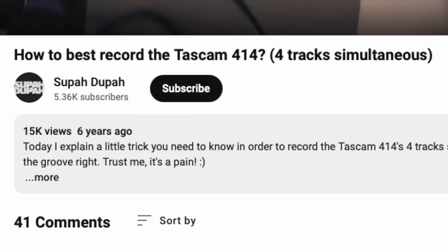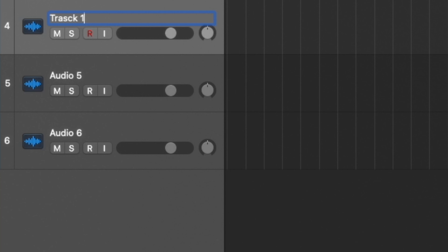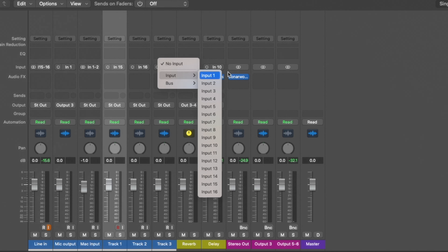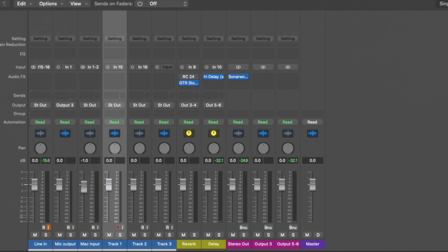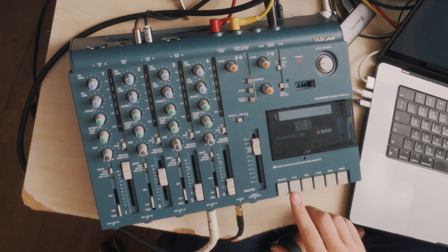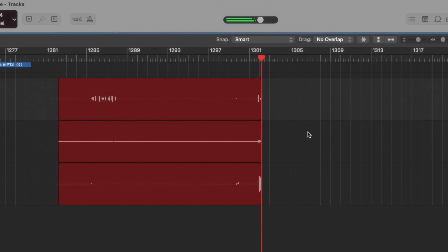The final way — at least in this video — to combine analog and digital is to use the four tracks, send them to the computer, re-record over the tracks, and essentially have unlimited tracks. Unfortunately track 4 comes out of the sync out and I don't have an RCA to jack cable, so we'll just use three tracks. Track 1 and 2 are coming into inputs 15 and 16 on my interface, and track 3 is coming out of Effect Send 2 into input 10. We arm the three tracks to record, press record on the laptop, press play on the cassette recorder, and there we go.